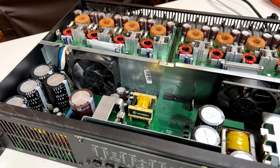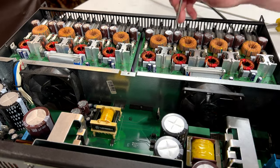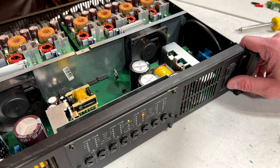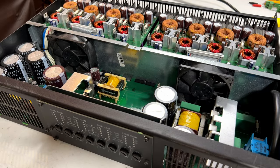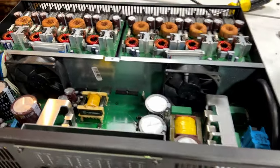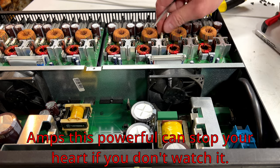What I'm going to do now is pull the fuse for the bad channel if I can — thinking ain't easy when it's incredibly hot down here. I'm going to pull this fuse right here. I don't want this thing trying to use that channel if it's failed. We've still got the fault, but at least the fuse is out now. Public service announcement: you've got to watch these things when you're working on them. If you complete a circuit like I just did, you'll get a zap from these things. So yeah, watch out.